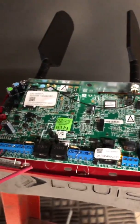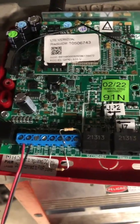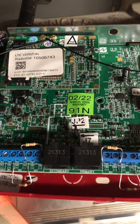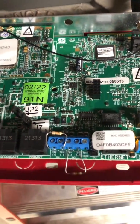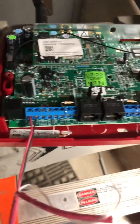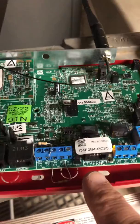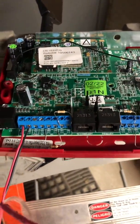Consider the guy who has to come after you — things will work out a lot better. The way we do these as far as wiring is obviously 24 volts coming in on the left. I did one the other day where we were going to use input two, three, and four for trouble, alarm, and supervisory. Input two didn't want to work for trouble, so I moved it over to input five — that worked fine. You can also plug your panel directly in to line one and line two for ethernet. Since we're not using lines on this Notifier panel, we're just going to be using the Notifier trouble, alarm, and supervisory relays at the bottom of the NFS-2640 panel. So our end-of-line resistors are all going down here.